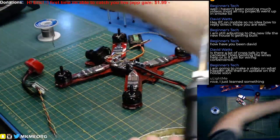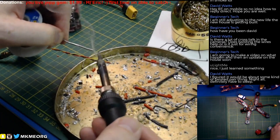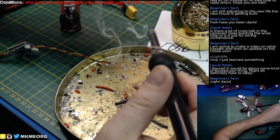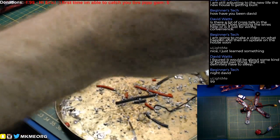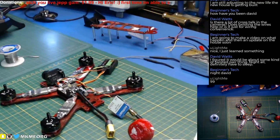Let's tin those wires up. This is my ugly splash pad of solder goopiness. I just replaced my soldering iron handle the other night and man I'm glad I did — I just bought a cheap eBay one to replace the WEP one. I run this thing wide open all the time — 450 degrees as high as it goes — and it runs wide open consistently. It does have temperature control but it's not the best, so when you forget and leave it on for a while it tends to cook itself, so I end up going through handles.